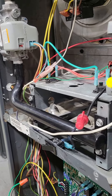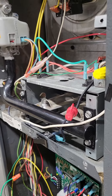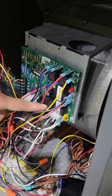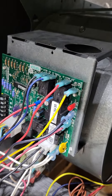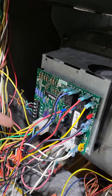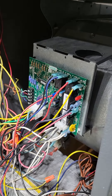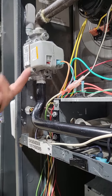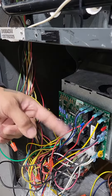There's also another one you could run into: voltage is not being supplied to your gas valve. I've had that before and that wasn't a gas valve issue — that ended up being a control board issue. Does that board send the voltage? These little black squares are all relays hooked up to your heating, cooling, and fan-only circuit. If any one of these fails, the board is not sending the correct voltage to the coil, and that's why the valve didn't turn on.